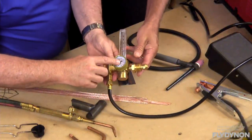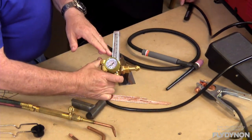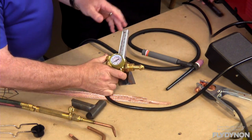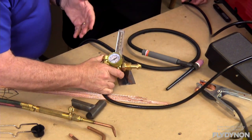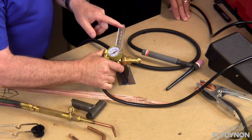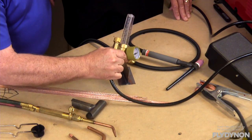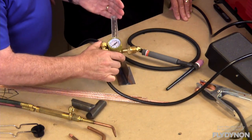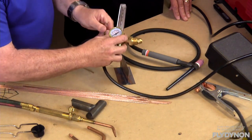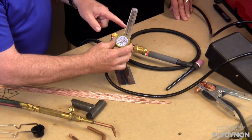You make sure you have pressure in your tank and then turn the adjustment knob until the little silver ball indicates your flow rate — that tells you you've got proper flow to get your shielding. Here's a larger TIG machine graphic that gives you an idea of that argon shielding gas tank setup. That shielding gas is doing nothing but protecting the weld — while the puddle is liquid it keeps all contaminants out of the weld, so you have just the electric arc and the argon shielding with no atmospheric contaminants that might weaken the weld.